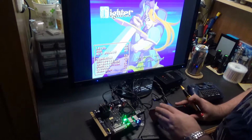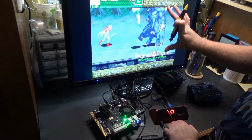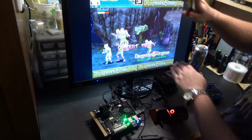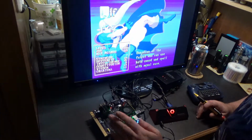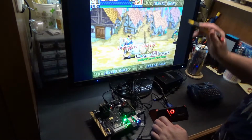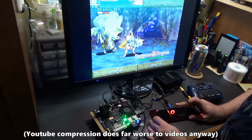One final tip though, if you're used to the HDMI screen, then you've maybe played around with the vertical integer scale with the cropping functions, the 5x crop. Do not ever use a 5x crop on the MiSTercade board, because it actually crops those lines off of the analog output as well. So yeah, don't do that. Just run with a normal scale like this, and make the people on YouTube deal with the quality drop there.